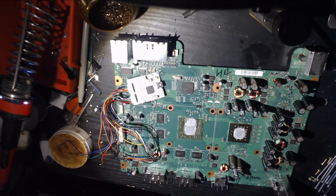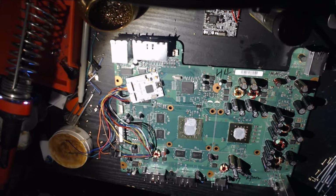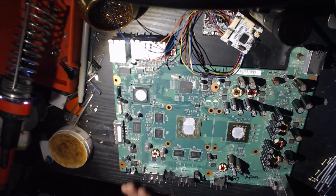Oh, one more thing to run by too. You're going to need these guys. You're also going to need the software down in the description. There's some extra things. AutoGG is something you are going to need, as well as the timing files for the ACE. It's very specific for the Zephyr. There's one that I use with very good results. It's not quite RGH 1.2 boot times, but it's consistent boot times, and you'll get some insta boots here and there. Very good for a Zephyr, and it works on all of them. I haven't had one that is deciding not to boot yet, which is awesome. Zephyrs are typically very, very unreliable and difficult to get running, and not anymore, which is a beautiful, beautiful thing.